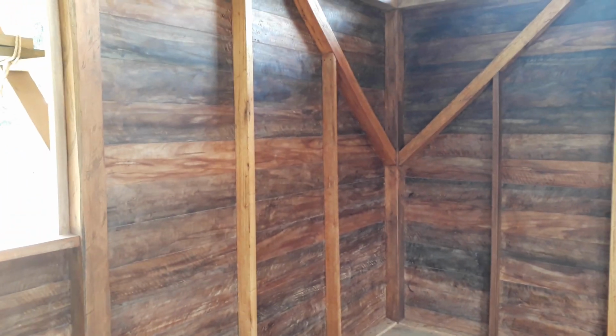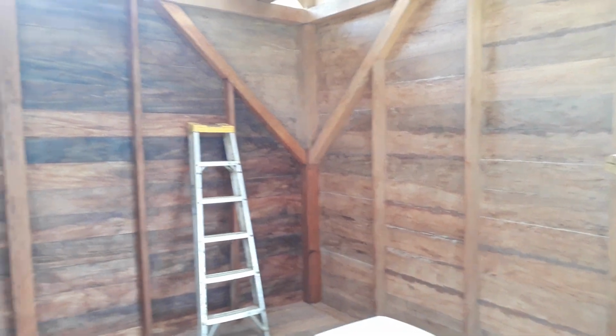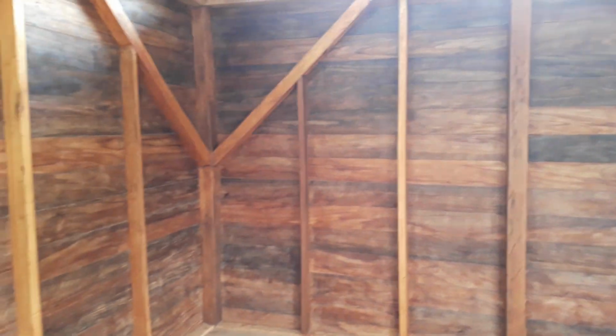But anyways, the humidity is relevant because we're applying linseed oil on this interior wall in this house. It's a hardwood wall. The wood is mostly dry, except the beams are actually not that dry, a lot of them, but the planks are dry. We measure them with a moisture meter. They have less than 10% humidity still in them.